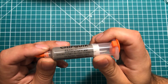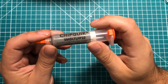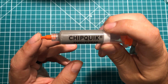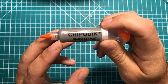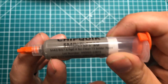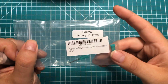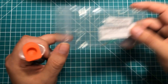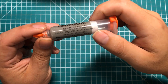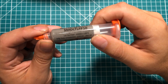Trick number one: you apparently need a low-temperature solder paste. You can use lead and some other things, but what people seem to like is this no-clean Chip Quick SMD LTL FP10 — I'll let you look at the specs right there. This stuff doesn't last very long; it expires January 18th and it is now something like June 3rd or 4th. It costs about 20 bucks but is apparently pretty special for doing this.